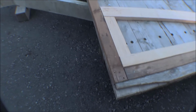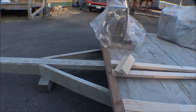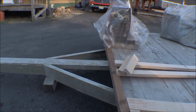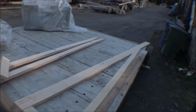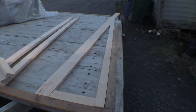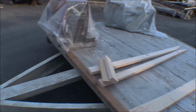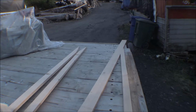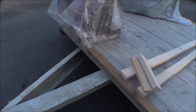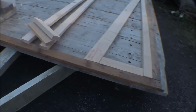And then I went up 6 feet up on the inside of this 2x4 and made a mark on that, and then took the tape. Well, actually, I measured 6 foot up there, and then I took a tape measure and run diagonally between that nail. Now that board I had nailed down all the way solid to the table. This one I just nailed down here on a pivot point, and then I measured 6 feet up on that, and then took a tape measure from the 8 foot point down there and measured 10 feet up here, and where the 10 foot line intersected with the 6 foot line, that was square, and then I nailed that down. So that gave me a square to work with.